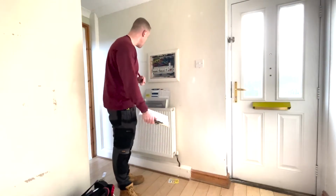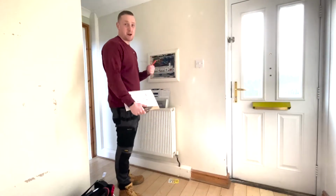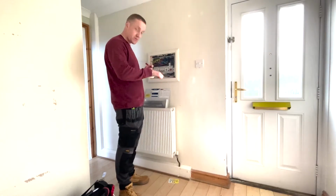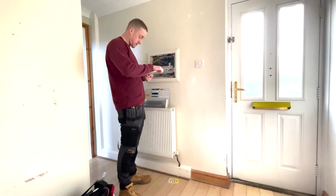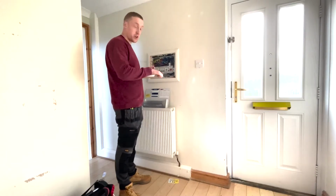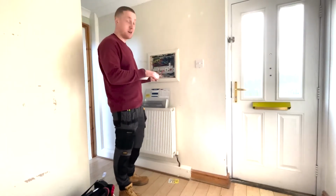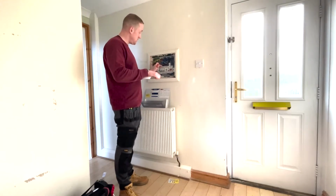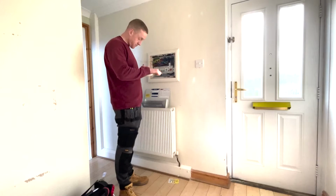Yeah, technically it's alright, but I've got some in the van, I might just drop it down to a 6 amp anyway, just for my own. Oh man. In fact, I will. I'll drop it down to a 6. I know it's not needed, but I don't have any 16s on the van, but I've got quite a few 6s. So if I drop that down to a 6, that gives me a 16 amp MCB as well. So that's what I'll do.